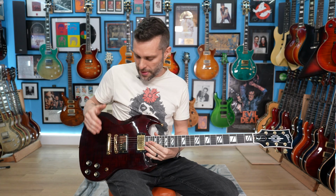In the case of this guitar, Jim's using a frequency-tuned capacitor. What on earth does that mean? A lot of the noise that you would get from a single coil, because of that capacitor, those frequencies are being sent to ground. And that actually, when you go to the middle position, you have noise canceling. Take a listen.